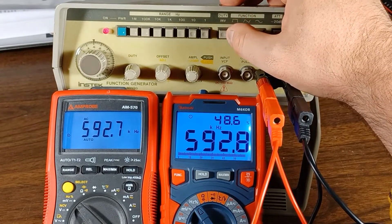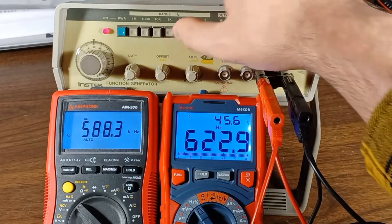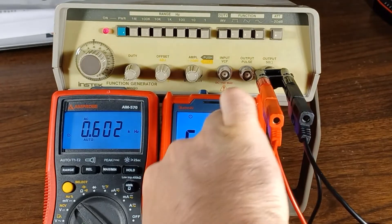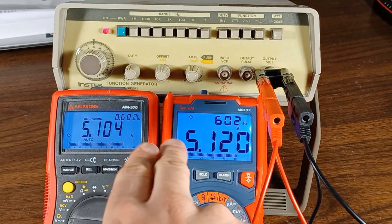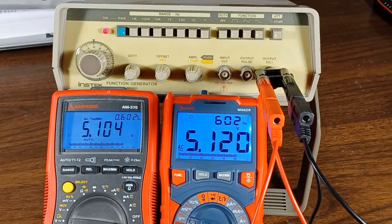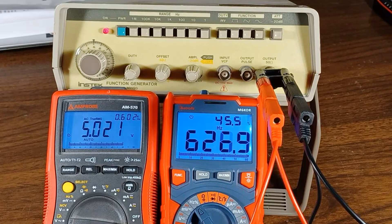Out of curiosity, let's go back to sine wave — I think we saw problems at 600. Yeah. So let's go back to the volt setting. We see it's stable here — we've got 602 hertz on one range and 0.602 kilohertz on another; it's just a different range display. But there's just something about this frequency setting that it does not work correctly.